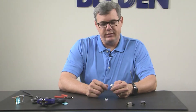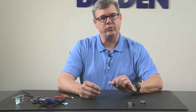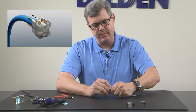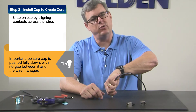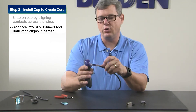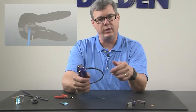This is my chance to visually inspect what I've done to this point. The last half inch of the cable should be flattened into the grooves and the white pair should be on the outside. White is on the outside, white is on the outside — flip it over and white is on the outside of both of those pairs as well. The cap goes in — the two tabs go down where the cable came up into the cable. You want to make sure as you push it onto the cable that it's fully inserted into the bottom of the cap. You can press it onto a hard surface to make sure. Once it's fully seated, we take the RevConnect tool. The tool is designed so that the product must be fully inserted or it won't engage. Insert it in — that black tab will come over onto the connector. We then engage the crimp mechanism which drives the pins in and cuts the pairs off.